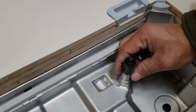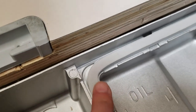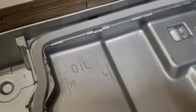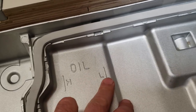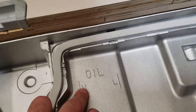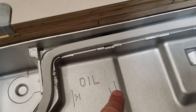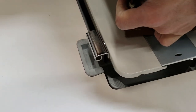You're going to put in the umbrella — this is very important. You've got to make sure this rubber is right there. It's not a rubber, it's an oil seal, just to make sure the oil doesn't come out. Before you start, you've got to put the oil in there. You see low and high — you've got to make sure oil is always at or close to high. You don't want it below this line.